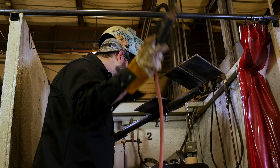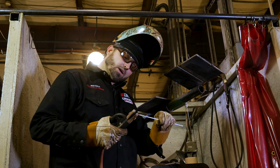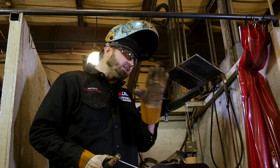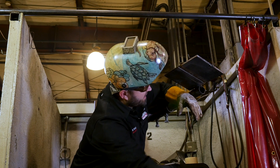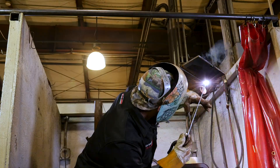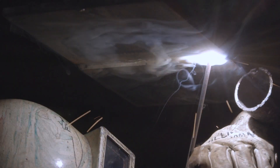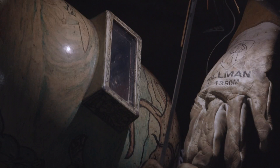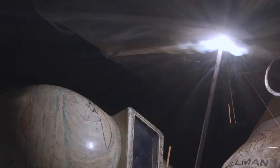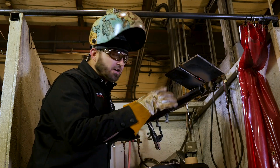We've got probably about five or six rods to run — got to run one little fill and then we'll put a cap on it. We're going to run it at about 90 amps with a 3/32 7018, running in the overhead position. We're going to run a slight weave or oscillation — not much — just trying to burn into the sidewalls and into your toe lines, your wagon tracks, and make sure everything's tied in nice and tight. Let's run us an overhead here. We're going to go ahead and finish running the rest of these beads and I'll show you what a nice, pretty cap looks like.